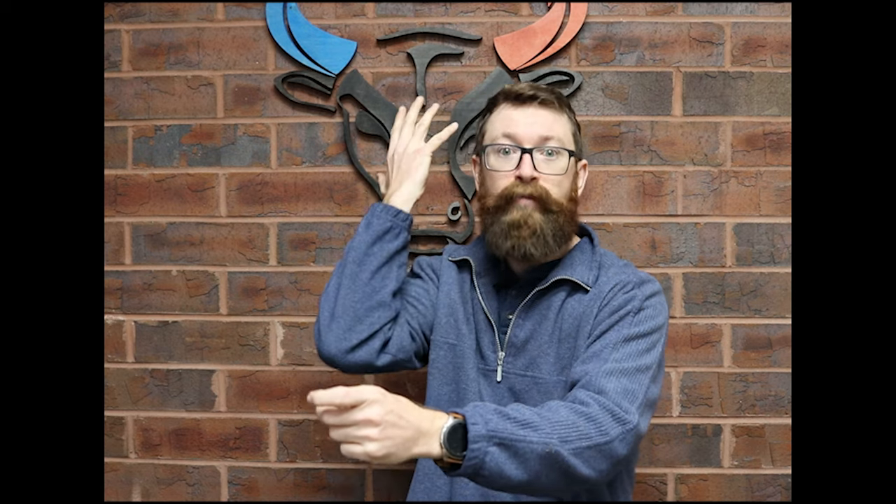What if I tear a shingle? Evidence of non-repairability. So you break all the seals and everything comes out fine. Now we take that same flat bar, go under the shingle, and put the teeth around the nail. You have the teeth around the nail, the shingle still on top, and you have to work the nail out using the shingle in between the flat bar and the nail. This is a big aspect of repairability — if I can't remove that nail without ripping the shingle up off of it, then it's not repairable.